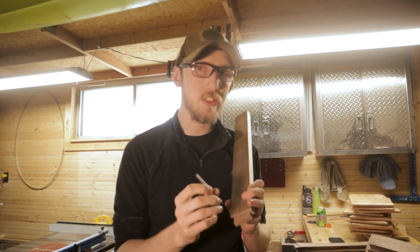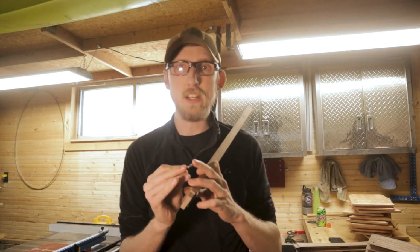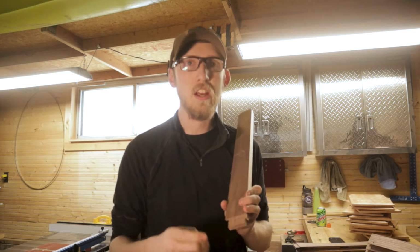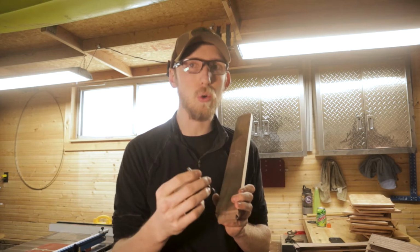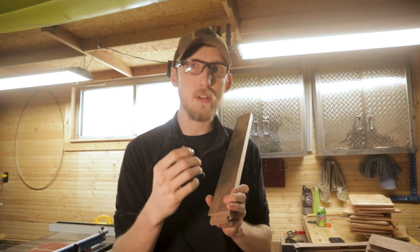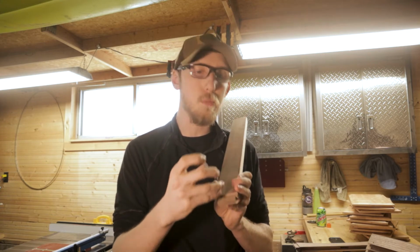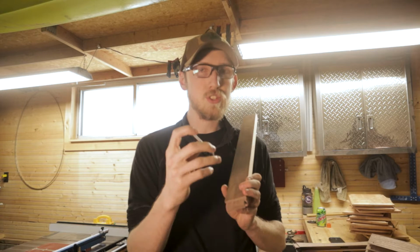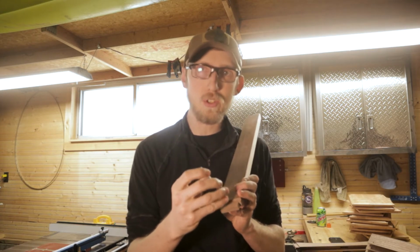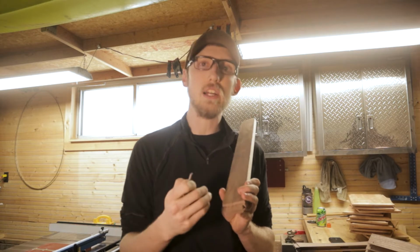And so when you're punching this one, what you want to do is you actually want to hit it decently hard so that the wings actually do touch the wood. This will make sure that you're deep enough that that will become the permanent registration hole for the brad point bit to drill into when you take it over the drill press. If you don't hit it hard enough, you may end up sinking the point into that initial bit that you hit earlier. So you're just moving it just barely over, just to the very edge of the one you hit earlier, and that will be just enough to create that drawboring effect.